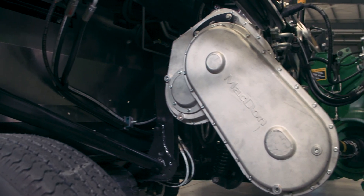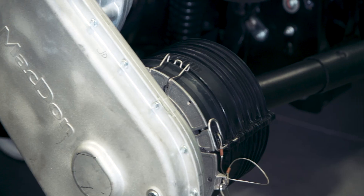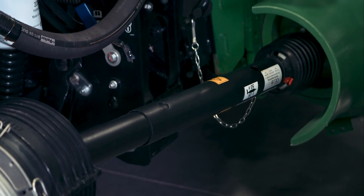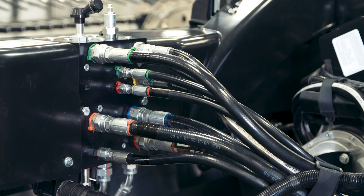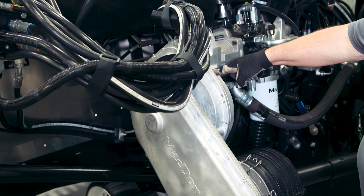On the left side of the FM 200 float module we have two gearboxes. The drive from the combine comes into our gearboxes, which in turn drives our hydraulic systems for our knife, side drapers, and feed draper, as well as mechanically driving our feed auger. An internal clutch provides slip protection for the feed auger.